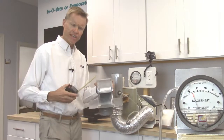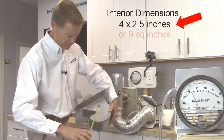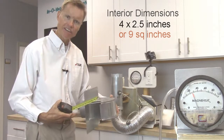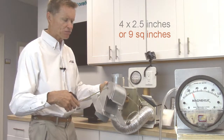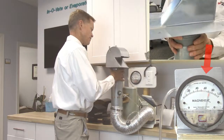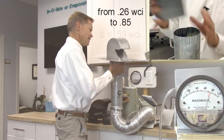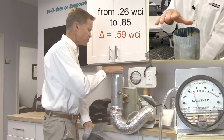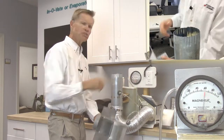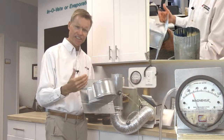This is a 4-inch gooseneck, popular in the south — we see this very, very often. I'm showing the measurements again because this is even more restrictive. This passageway not only makes the 180-degree turn, but it's also diminishing in size as the air goes through. Wow, that pressure goes up so high — it's like putting my hand over half that vent. It's almost up to 0.90 water column inches of pressure. That's a lot of delta, a lot of restriction, a lot of wasted energy, and lint is going to build up faster.